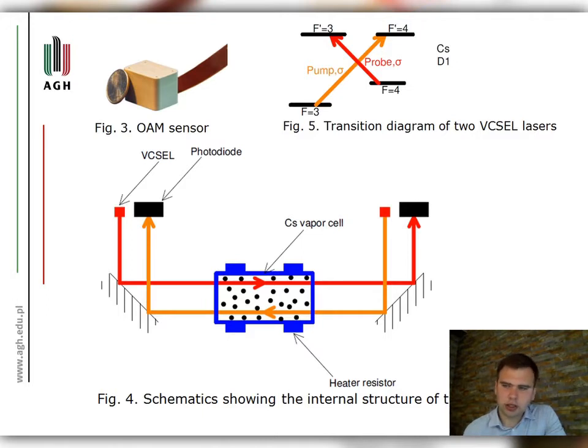For magnetometers using alkali atoms, all methods rely on incident resonant light driving an optical pumping process in the atomic sample to create polarization of the particles in the magnetic sublevels of the hyperfine ground states. The resulting atomic polarization moment then couples to the magnetic field to be measured.